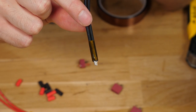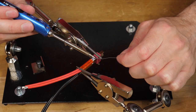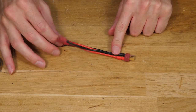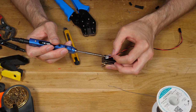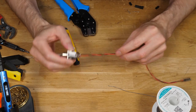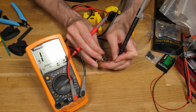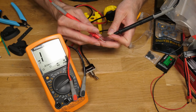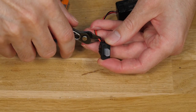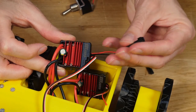If you're doing it without the kit, you can also make the battery splitter harness at this point. This is pretty simple to do, as long as you have a soldering iron with a large tip. The wires and connectors are large and take quite a lot of heat, so some helping hands can help too, to prevent you burning yourself. Now is also a good time to build the kill switch wiring — just a couple of cables and a connector. I used Molex SL, as it has a locking connector, but JST SM or DuPont connectors would also work well. At the same time, you can check which orientation the switch needs to be using a multimeter, or by setting up a simple circuit to know when it's on or off. The last thing to prepare is one of the ESCs — this will be connected to the kill switch, so you'll need to cut off the existing switch and wire in the connector instead, one that matches the one you put on the kill switch.